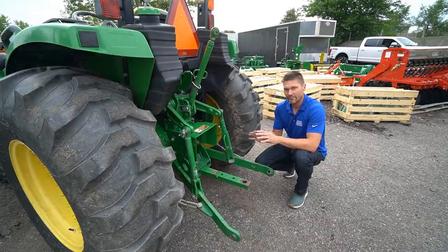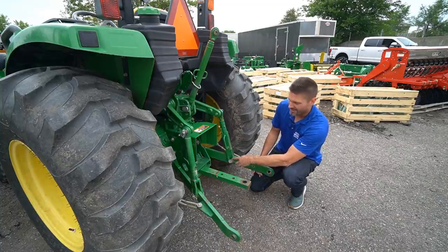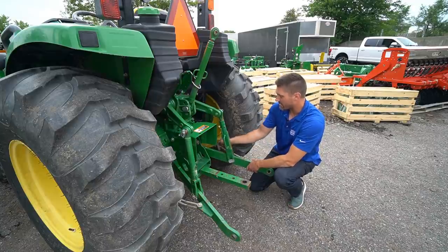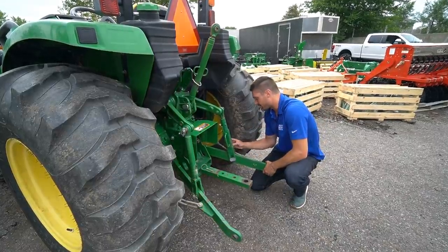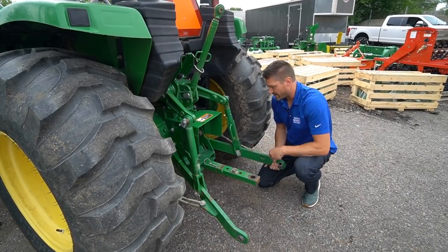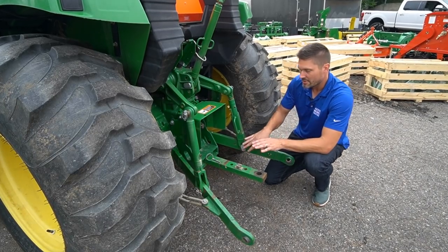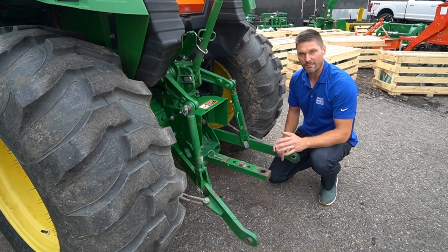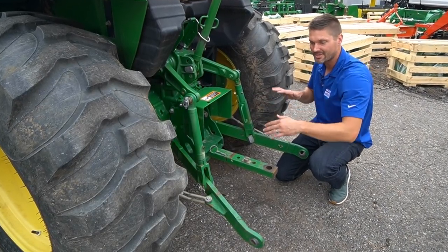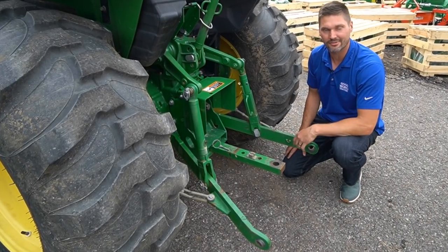This tractor is one of the few models — in the John Deere world and some Kubotas — that has a feature I call draft float control for the draft links. I wish more tractors had this. I'll simply pull out the retainer pin holding it in place, take a little pressure off, pull this off, wiggle it out, and rotate it 90 degrees. This gives it a little more flexibility — you do this on both sides for independent lateral flexibility. So if you have a finish mower or brush hog that gets a little crooked on hills, it gives it the wiggle room to contour to the ground without twisting the frame.